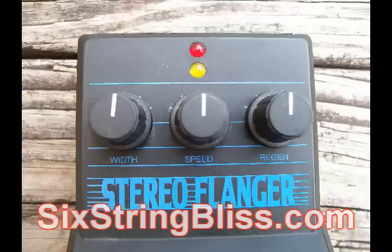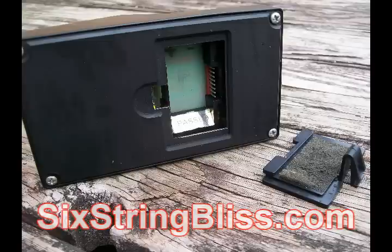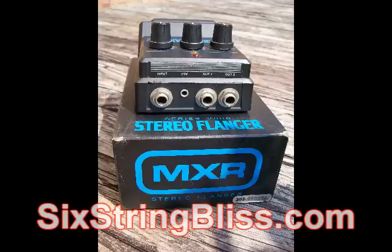The controls on this unit are pretty standard flanger controls. The width knob varies the range of the flanger's sweep. The speed knob adjusts the time delay sweep speed. The regen knob, short for regeneration, returns a variable portion of the signal back to the input to be reprocessed. As with most stomp boxes, this pedal can run on a standard 9-volt battery or a bit of a non-standard wall wart type power supply.